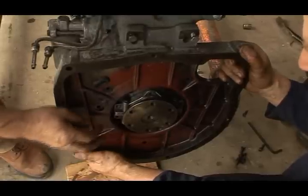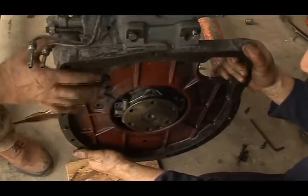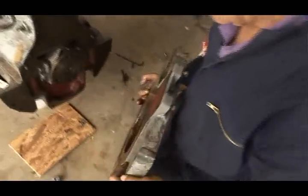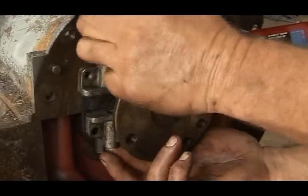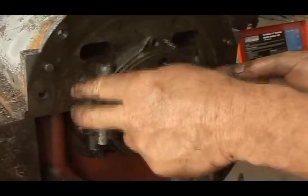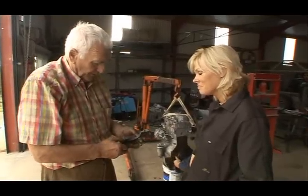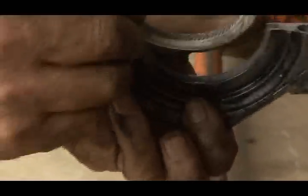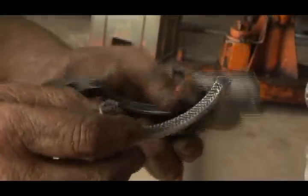Right. Even with the studs removed from the housing, you'll find that you won't be able to get into the seal until you remove the flywheel housing first. Okay. This is the boy here who's causing all the trouble letting the oil out of the engine. It's only a wee rope seal. There's one of those in the bottom, and the other goes in the top.